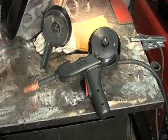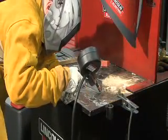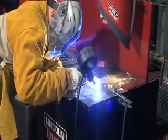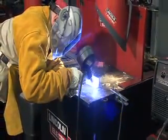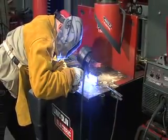If you're going to be doing a lot of aluminum welding, you might consider moving up to a spool gun. In fact, you might be able to add a spool gun to your existing welding system. A spool gun allows you to feed wire through a short liner instead of a long liner, which will eliminate a lot of your feeding problems and allow you to make welds all day long without the cobbles that you sometimes have with the push system feeding aluminum wire.